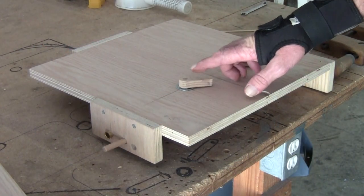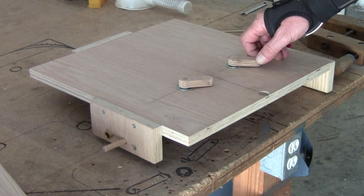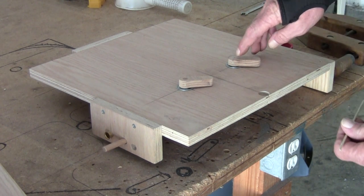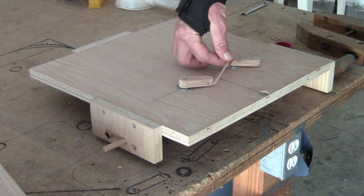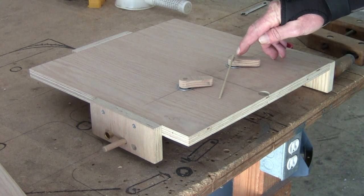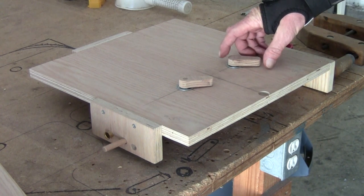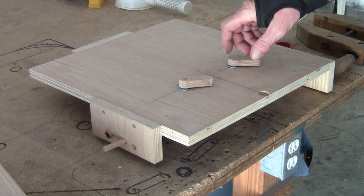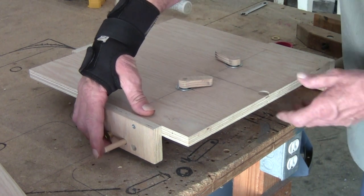Okay, finally got the flippers figured out. Okay, this is not ready yet, but if you noticed, I did drill a 1/8 inch hole. You can barely see the peg here, but this goes through about 3/4 of the way to give it extra strength on the 3/8 dowel that's going through this. Okay, now this one's ready to go,